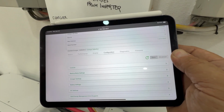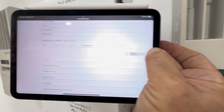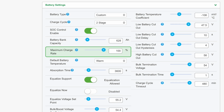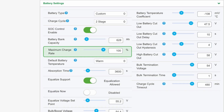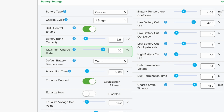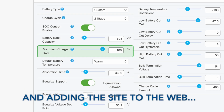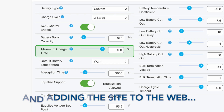I guess you could buy an older iPhone and just stick it there and use it and hook up a charging cable. Okay, now I'm getting distracted. All right. Now, of course, I don't mean to gloss over all the settings that are necessary for converting from flooded lead acid to lithium. This is an older XW, so it doesn't do state of charge, but it will allow me to change the voltage for charging and the indicators, and then I'm able to add the state of charge in the display when the customer logs on to Insight Home. So, I'll leave all that out.